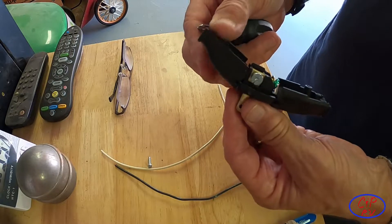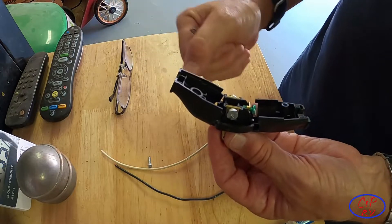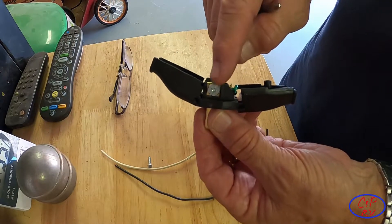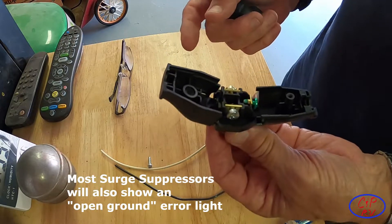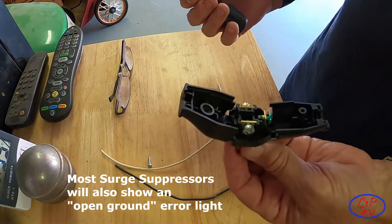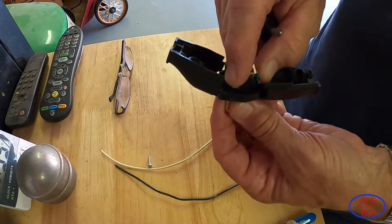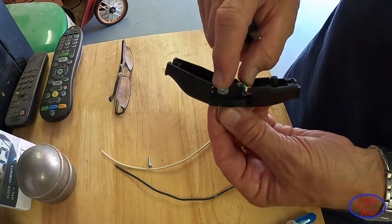This is essentially the way that a home is wired or an RV park is wired when you go to plug your 30 or 50 amp connection in. Back up the line the neutral and the ground are bonded together, and that's what your transfer switch is looking for. If you have an inverter in your RV you may also run into the same issue where it's not recognizing that your generator is connected, because those two must be bonded together.